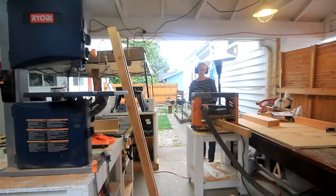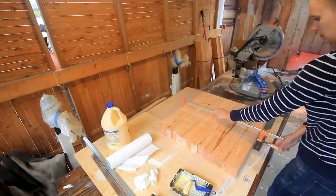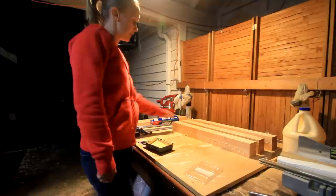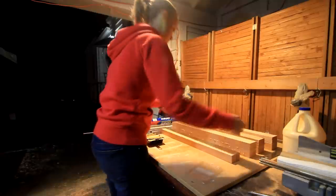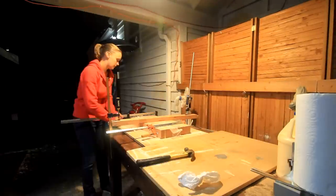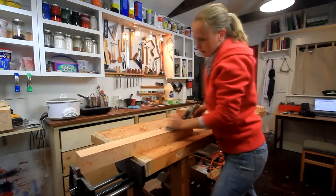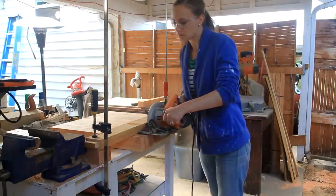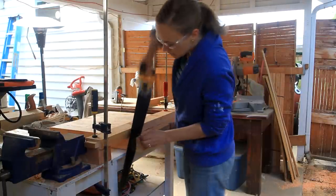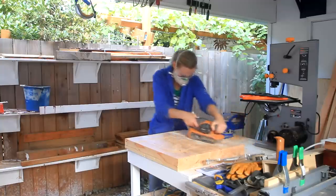I planed all the boards and glued all the boards for the top together, being quite generous with the amount of glue I used. I also used the same wood for the legs, gluing them together. To clean the boards up I used a jack plane. When the glue in the top had dried I cut clean sides with a circular saw and finished off the cut with a handsaw. A little sanding and the top was in pretty good shape.